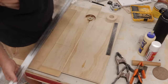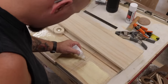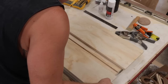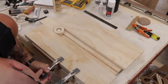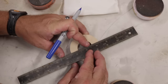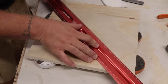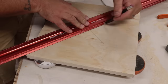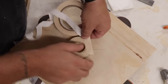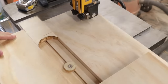I marked out lines for where the top sheets of the table would go, then cut plywood pieces to fit on either side of the donut path, creating a channel for it to travel. Using wood glue and super glue again, I secured everything. I brought it back to the table saw and made the final cut into the top layer. To fasten the workpiece, we use double-faced tape on the back of the donut and cut away the excess so it doesn't grip the table itself — that's what secures the cut piece to the jig.